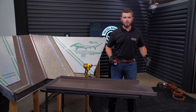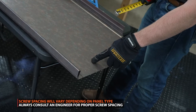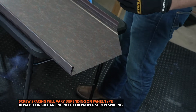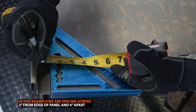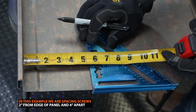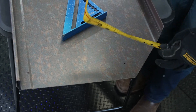The fastener spacing depends on the actual width of the panel. On this 18-inch wide panel, coming across we'll probably go roughly every four inches, spaced evenly, and then up the valley. As we come more into an angle, it's going to require more fasteners. I'm just going to split the difference at three and a half. Now we are ready to install this panel.